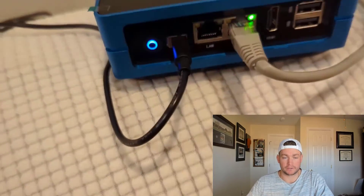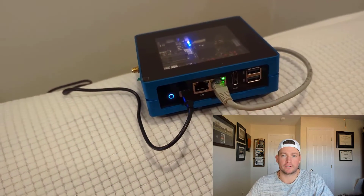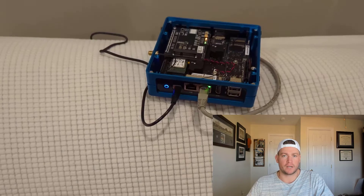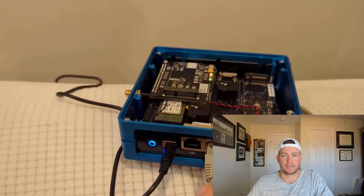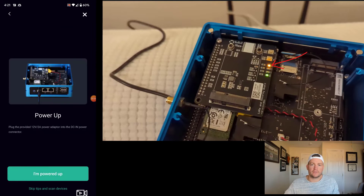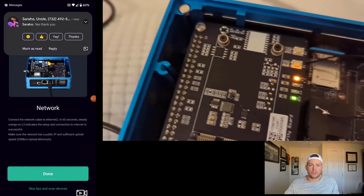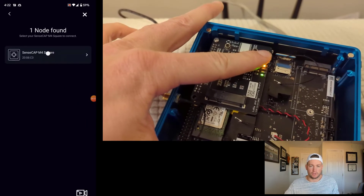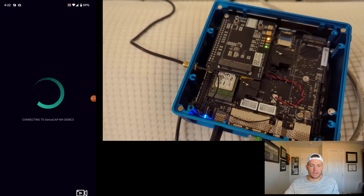Now let's get to the actual setup of the device. After unboxing it, you're going to want to plug in the power cord and the ethernet port, then wait about 10 minutes for it to boot up and install any updates — I waited about a minute and got an error, so just give it 10 minutes. While you're waiting, you can download the SenseCap app and create a username and password; you'll need to verify your email with a CAPTCHA and an emailed code. You can tell your device has network connectivity by the solid orange L3 light. Then connect your phone to the device with Bluetooth by holding down the B1 button until it turns blue, and it'll come up on your device to connect easily.